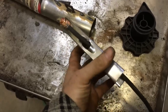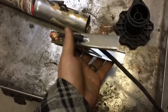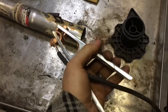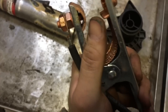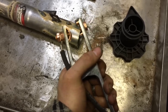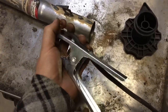Now your ground clamp — something my Hobart doesn't have — it does not have a hole in the handle. So the Hobart clamp is kind of crappy. This one has a lot of tension on it. The Hobart one is kind of loose, and this has a better grounding surface anyway, because the Hobart has two round things — I call them half moons — instead of one clamp. This one is set up like a flat clamp, which holds it better on pipe. You have to put this one together out of the box too, but that's pretty simple — you just take the nut off, put that on, and tighten the nut up.